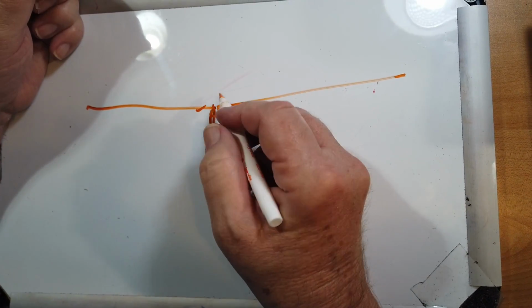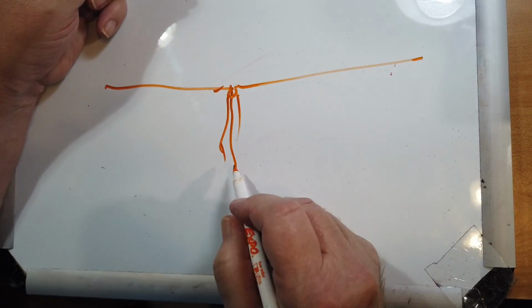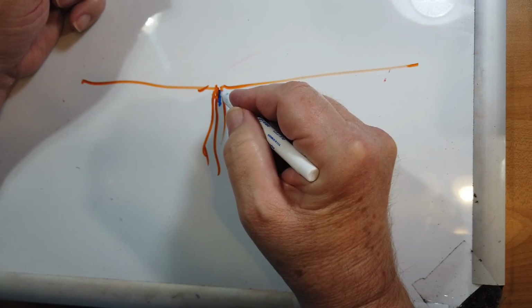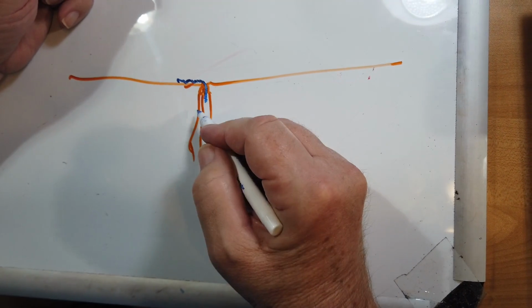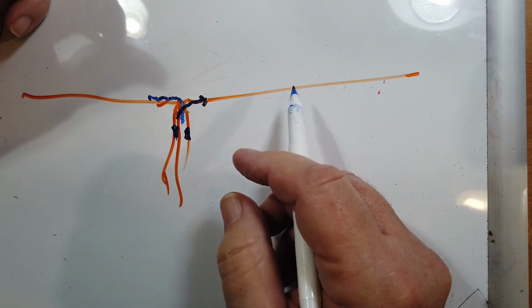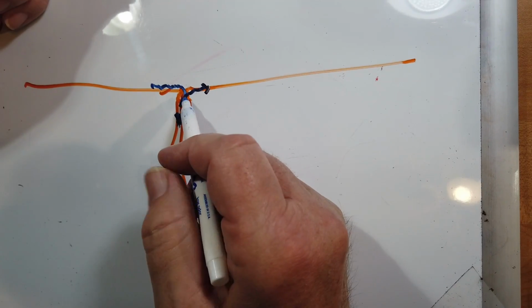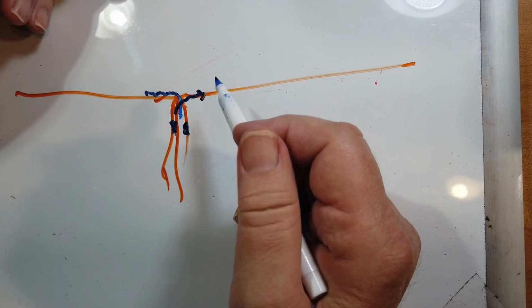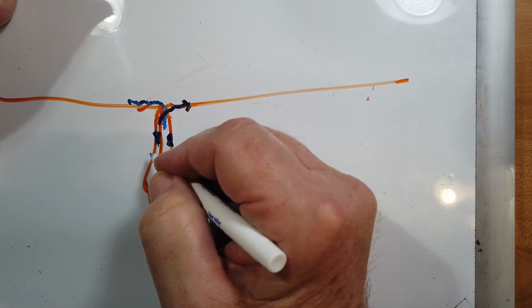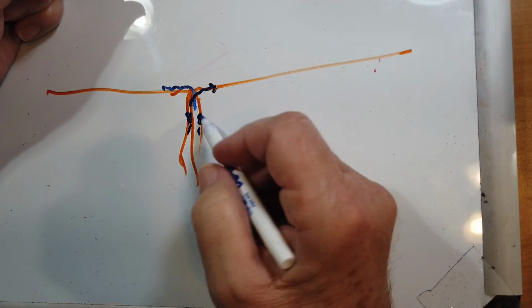So you're feeding the one side with the center, the other side with the braid, which is a time-honored way of feeding coax. Now the problem is you've got energy coming up inside the coax, and it'll go out there, and you've got the return, which is the inside of the shield, goes out there. But the way you connect it, you just take the shield, wrap it around here. There's no way at this point at the top of the coax of keeping that from contacting the outside of the shield. You say, well, good grief, it's one wire, it's a shield. Well, at DC that's true, but at RF, the RF tends to travel on the surface. So it travels on the inside surface of the coax.